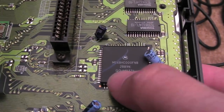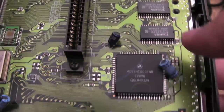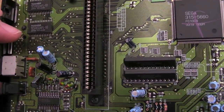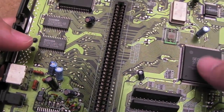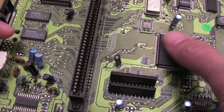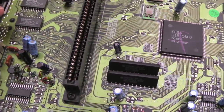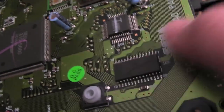We've got a 68000 processor down here. It's the PLCC version on these. A couple of Toshiba RAM chips there. And typically, the only faults you get with Mega Drives in general, as long as your VDP doesn't fail, well, this probably has something else combined with that. It's not just a VDP. I think the Z80 maybe merged with that on this as well, because I don't see, unless that's it there.